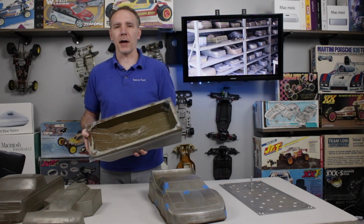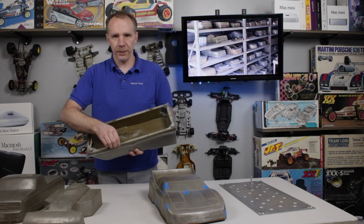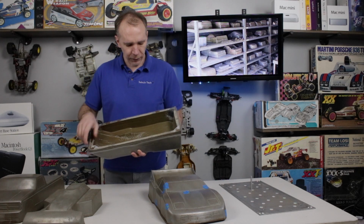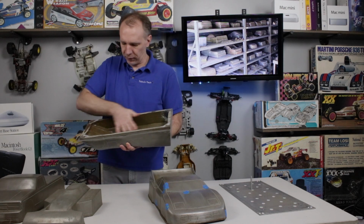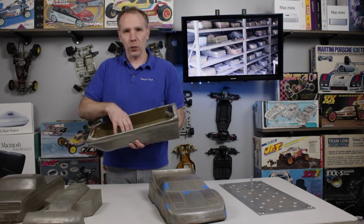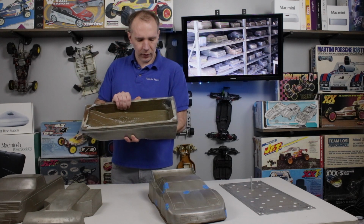Now, a lot of the manufacturers for the two-part epoxy recommend a minimum and maximum thickness on their parts. And I think it's generally around 1 inch for a lot of them. And so you've got to come up with a plug when you're casting that you pour your stuff in, and you put that in there to create your cavity. And you got to make sure you get it fairly accurate to what your final thickness needs to be. So that can be a little tricky as well to get that all correct.